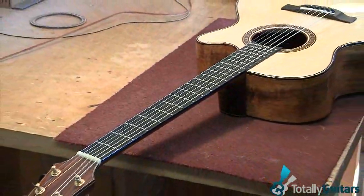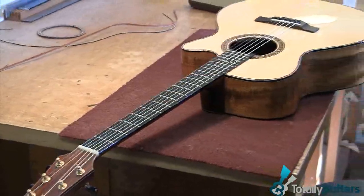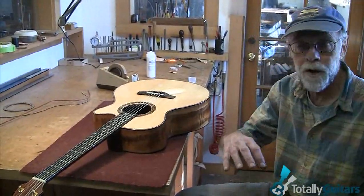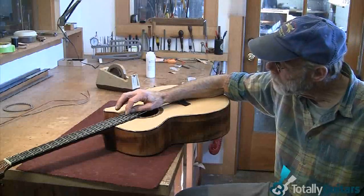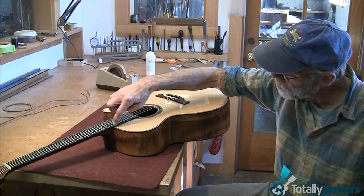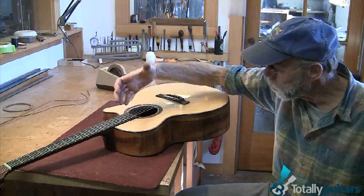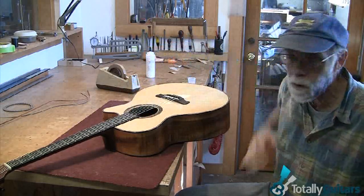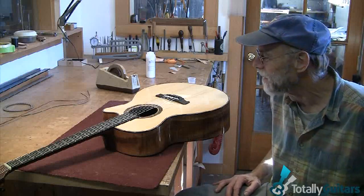On this fret wire — have you found it to be really consistent from shipment to shipment? Yeah, it's just so consistent. Most other fret wires are too fat for your average slot, which is kind of an industry standard width. A problem you have is when you put the frets in, it can really bow the neck back. I fret the necks before they go into the guitar. If your fret tangs are too tight for the slot, it will cause this section of the free-floating fingerboard to really bubble back and bow down. I've seen guitars where, when the neck was clamped down, there was so much pressure it would actually crack the glue lines in the rosette. This fret wire is the only wire that doesn't do that, to my knowledge. They never come out either — they're just the perfect fit.